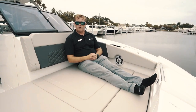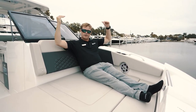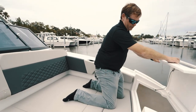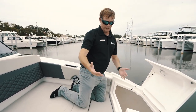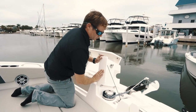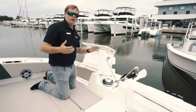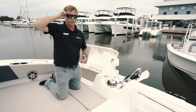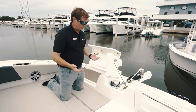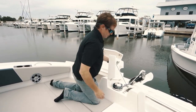As an additional option in your bow, there's a manual sunshade system — you simply put your rods in and then you have a convertible sunshade. In the bow area, we've got lockers to port and starboard that simply mimic each other. In here, we've got our windlass and a hand control for the windlass tucked in, so you can simply pull it out and operate it. On this size catamaran, since she's 32 foot, you don't need to use a bridle system. Typically on larger catamarans you utilize a bridle at anchor, but it's not needed here — she's not going to rotate that much while she's on the pick. Very simple for anyone to use.